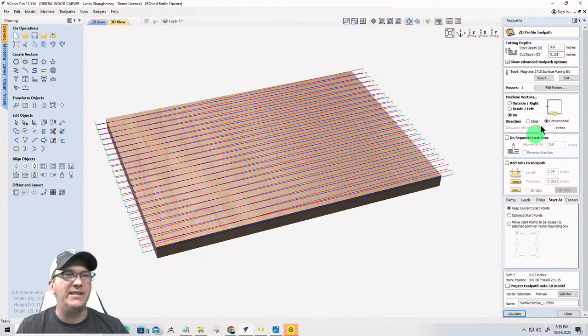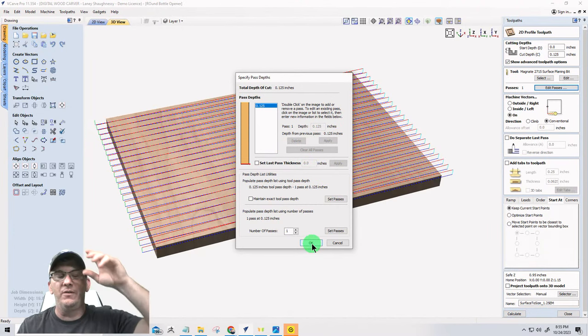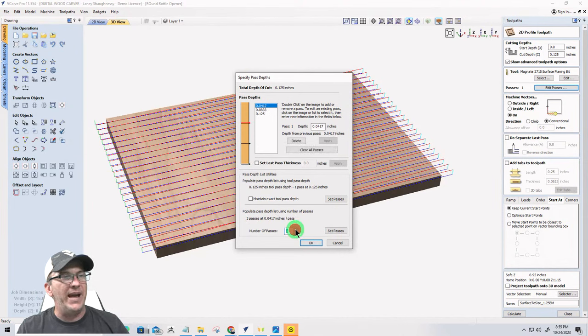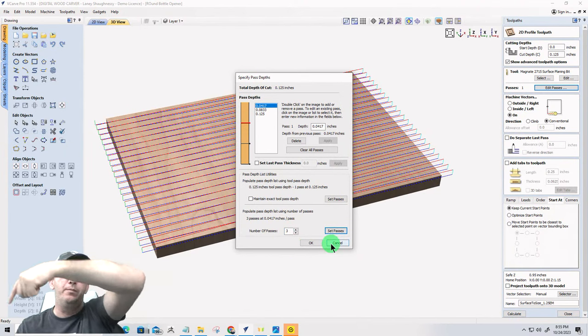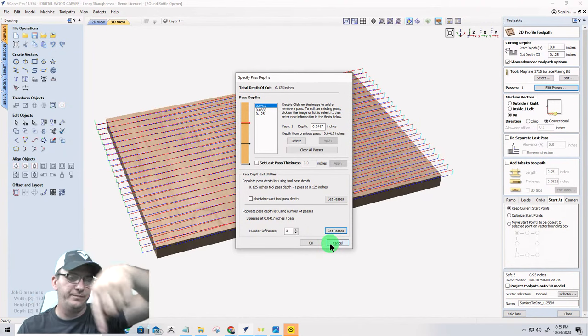It was doing four passes because I had it set to four passes. I was talking earlier and showing how, if they wanted to edit passes to remove that material, if they thought it was too aggressive because it was on two-sided tape and not being clamped down, they could adjust their passes. And I forgot that I set it to four passes. It would cut a pass, raise up, pass, raise up, pass. It would do the four passes and then move to the next one.